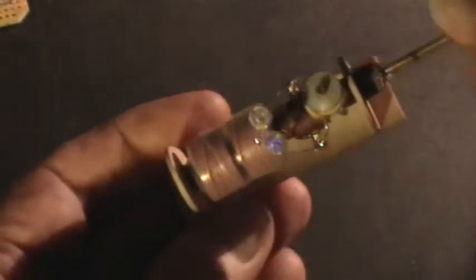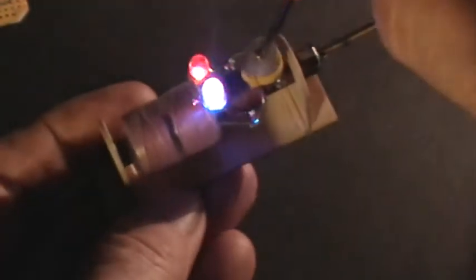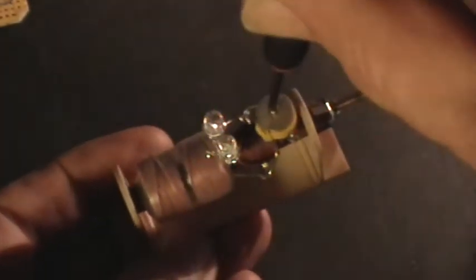It went out there for a minute — look at that. There's some orientation sensitivity to that, and of course changing the inductance changes the resonant frequency of the receiver. It looks pretty good out there. And changing this capacitor setting — very sensitive to the capacitor setting.